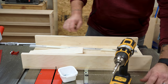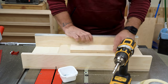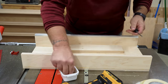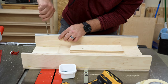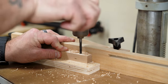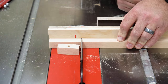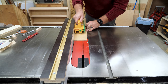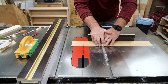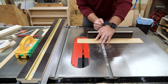While I had the drill handy, I installed a piece of T-track on the top of the front fence. I used to avoid T-track because of the cost, but it's kind of imperative for this sled to function properly — I'll put a link in the description; it's not fancy but it's cost effective. For the stop blocks, I had some hard maple scraps that were just the right size — three quarter inch by three quarter inch square. I drilled a quarter inch hole in the center of the last two inches of that maple square, cut that two inches off, then cut one more piece three inches long. I also cut eighth inch tempered hardboard for the other stop block — one piece at three and three eighths by three inches, and another at one and three quarter by three inches.